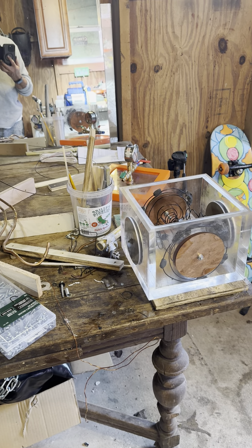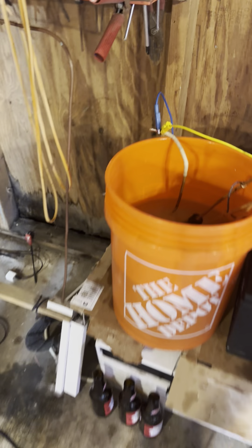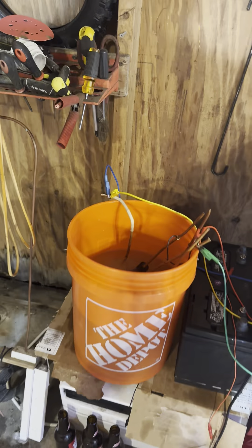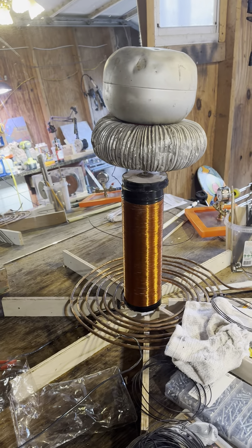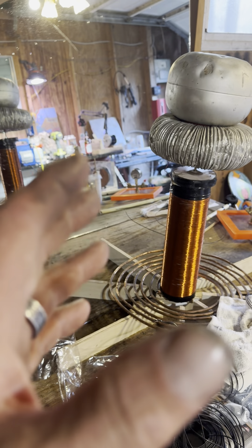On the electromagnetic field side, we're coming off the capacitor bank on both sides. The capacitor bank is going to be made from beer bottles, each one nanofarad, and we'll start off at around 8 to 12 nanofarads total. Seven to eight bottles should probably get this into resonance.